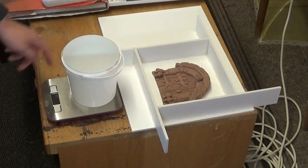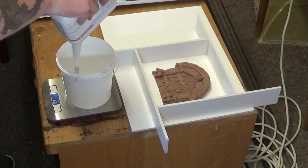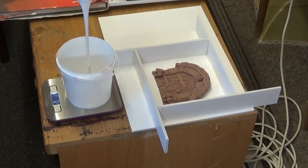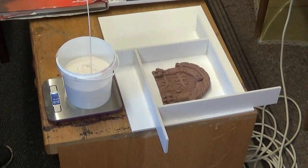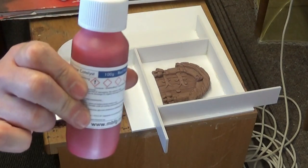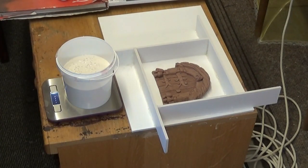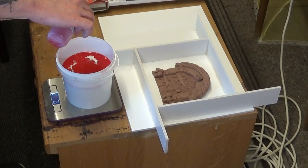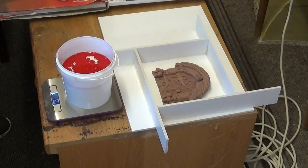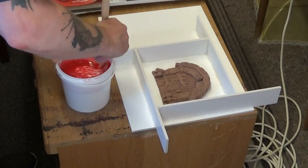By the way, I put a materials video up recently talking about silicone, so you can have a look at that. There's the tub of base silicone — a one-kilogram container, though I could only squeeze out about 800 grams. The other 200 grams didn't want to come out, so I needed to pour the container upside down. There's the catalyst — a red catalyst — that will allow us to work within a 40 to 60 minute time frame, which is plenty.